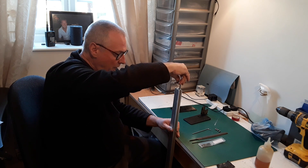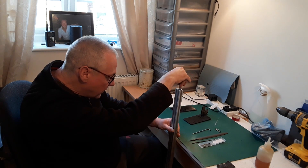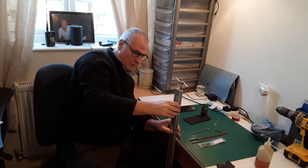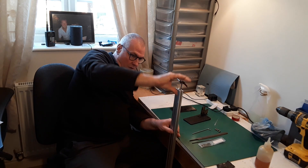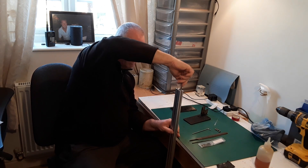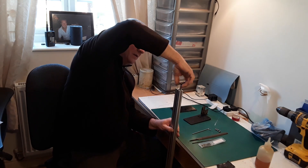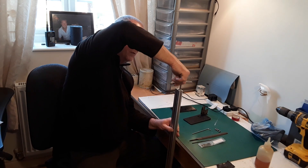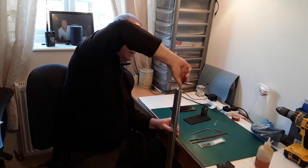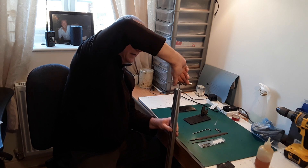Just eye it up — that's close enough. Give it a couple of turns, eyeing it up for straight. Looking this way it's a tiny bit off, but not too bad. That's pretty good, I'm happy with that. I'll just wind that in, turning the tap back every so often to relieve the swarf, though to be honest it's not really taking a lot out on a 5mm thread.